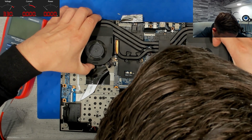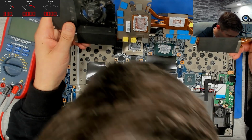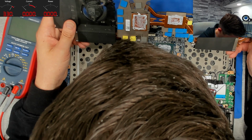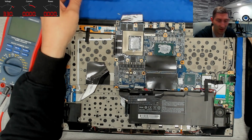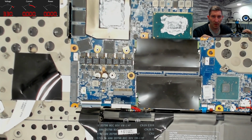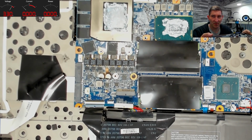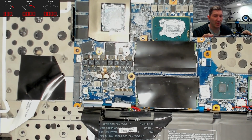Careful. Okay. Wow. Got scammed. Do you see this? The 8 coils in a row for the GPU. In the middle, there is something. That's a hole. You know I'm a specialist for something like that. There is a phase missing. So they probably have messed with the GPU.